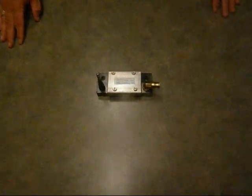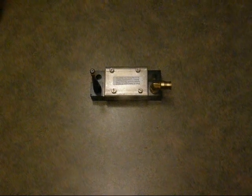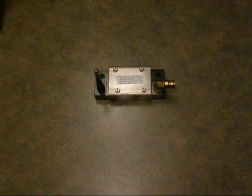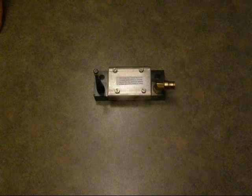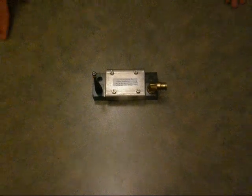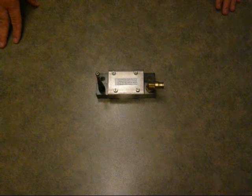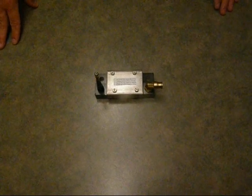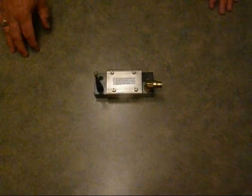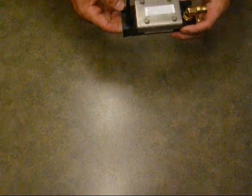When mounting the sensor, you can choose any location on the truck, providing you're getting the signal from the sensor in the cab or from any other area you want to use the handheld. It may be a loader or it may be on a crane and so forth. Check that you're receiving the signal from the locations that you want to receive the signal prior to permanently mounting the sensor.